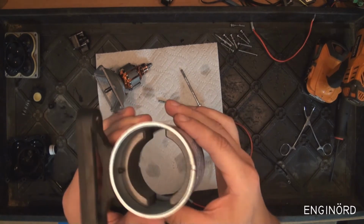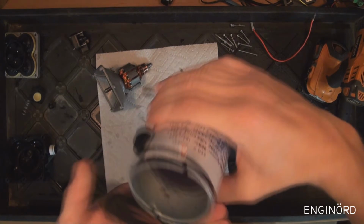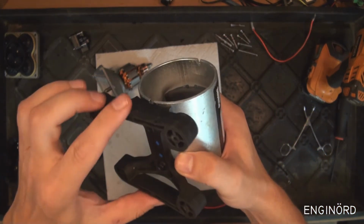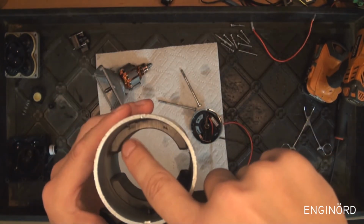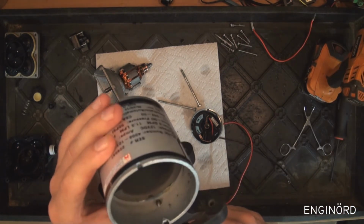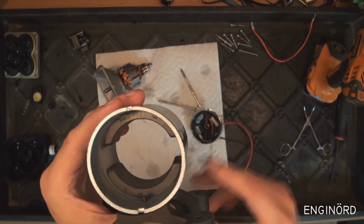That's one of the cheapest ways to do it. It's just an extruded housing. It's got these threads cut into the housing. There are two bolts holding the feet inside the housing. And you can see there are two permanent magnets. They've been making these magnets for 150 years. They are dirt cheap. Some of the engineers call them arcuates.